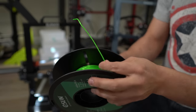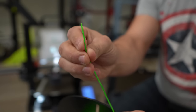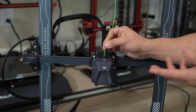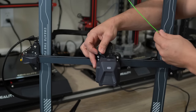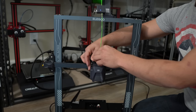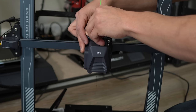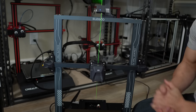Try to bend and flex the filament so it gets as straight as possible, then cut it at a nice 45-degree angle — it should be a nice straight pointy tip. Before you install it, heat your printer up. Get the hot end to its operating temperature, or whatever the filament packaging tells you. Depending on whether it's a Bowden or direct drive setup, there's going to be a little lever gear somewhere on the printer that you can open and close. While you feed the filament in, open that little lever and it should pass right through. With the printer warm, push the filament through very lightly and it should start melting, and you should start seeing filament come out the bottom of the printer head. You shouldn't have to push too hard. And that's it — filament loaded.